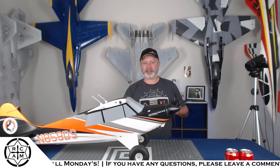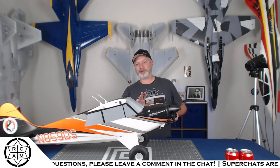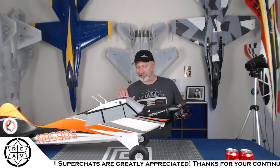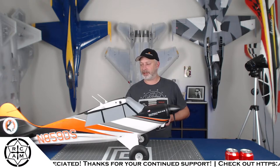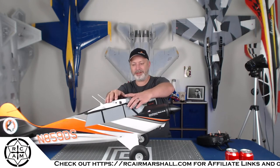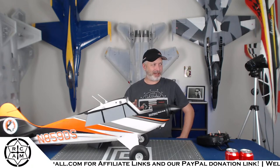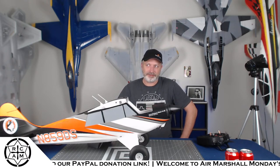So that's what's nice about these Avian ESCs: they give you all of that data right on the screen, so I don't have to hook it up to a motor test bench or anything like that. I can get everything that I need right on the screen. I'll test it again in flight, where we get it off the ground and test it unloaded, and I'll do a max run and see what it hits. But as of right now, we're pulling over 50 amps. So with the stock ESC, I don't know that I'd run it. Maybe 5S is okay on the stock ESC. I don't know.